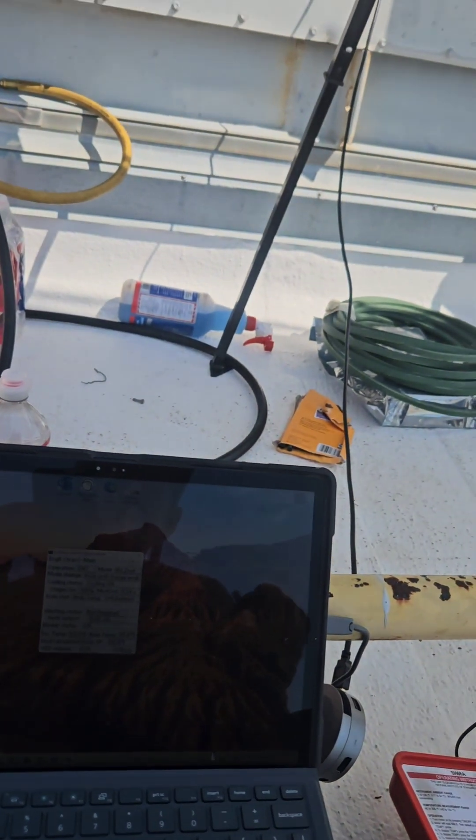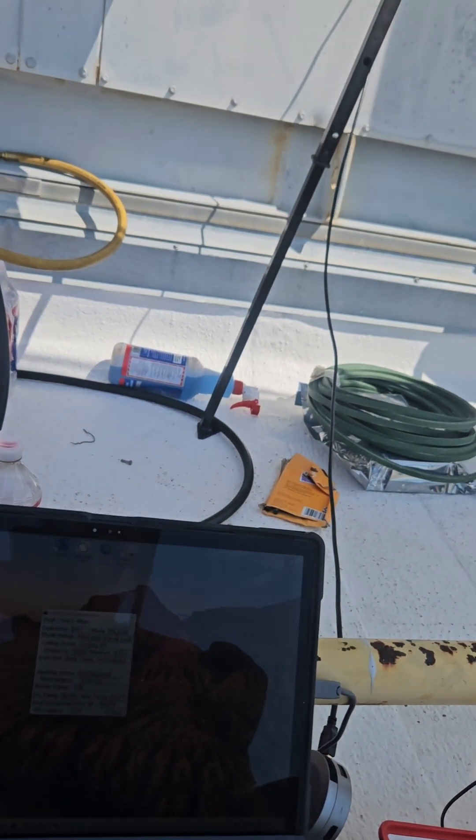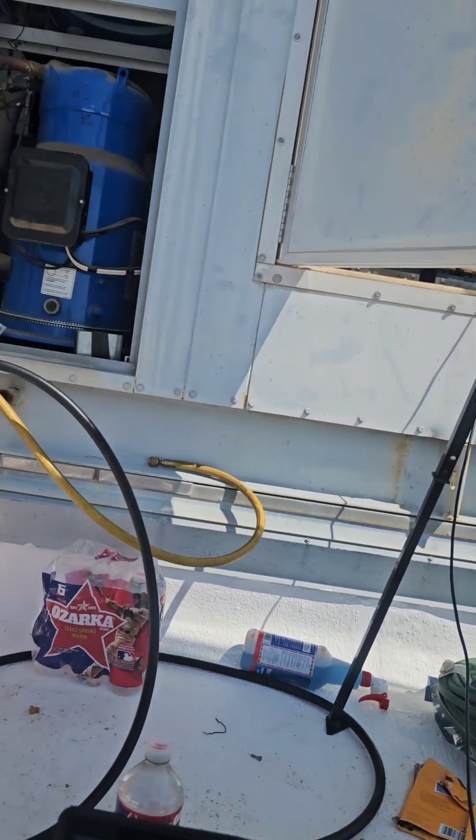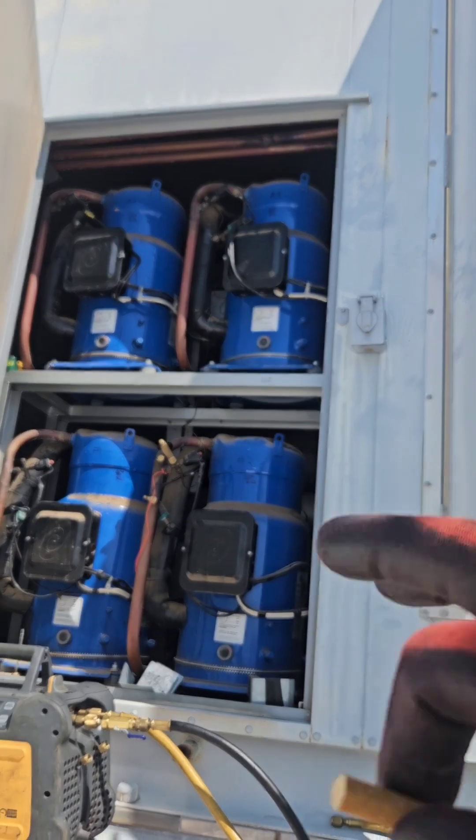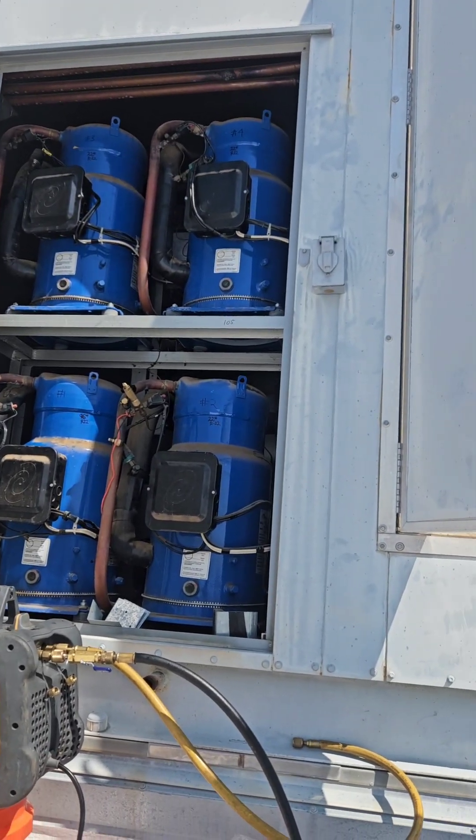I have a lot of overrides on right now because I'm trying to run the whole thing and see how every operational compressor is doing. You can see the oil bouncing in the sight glasses, which is a good sign, and they're not foaming.